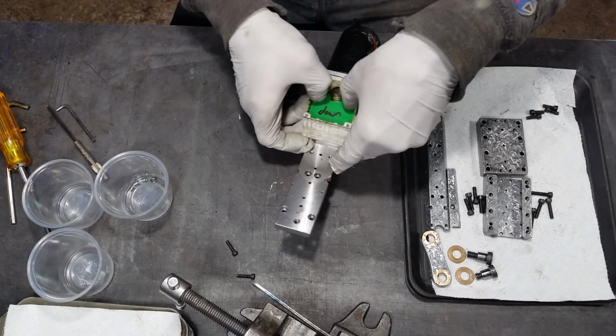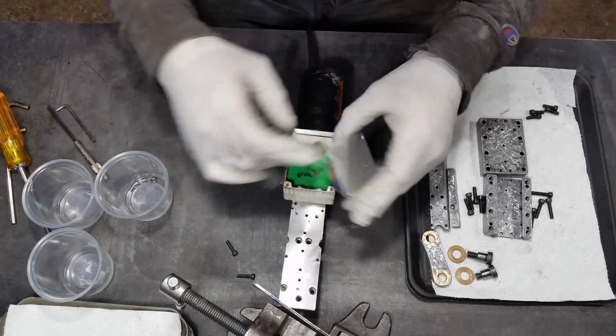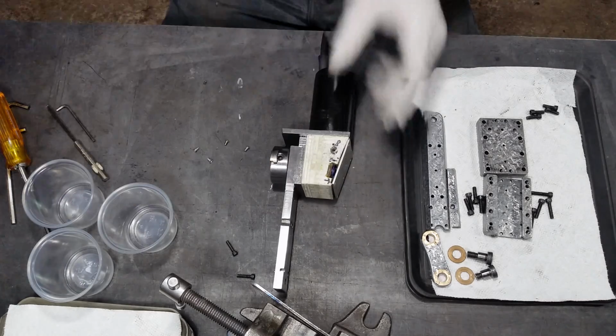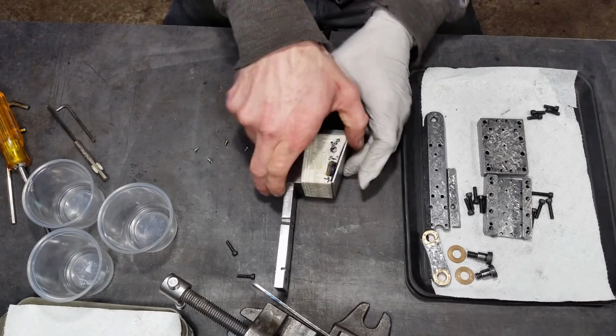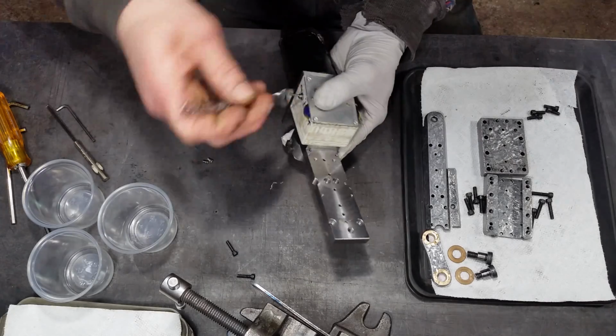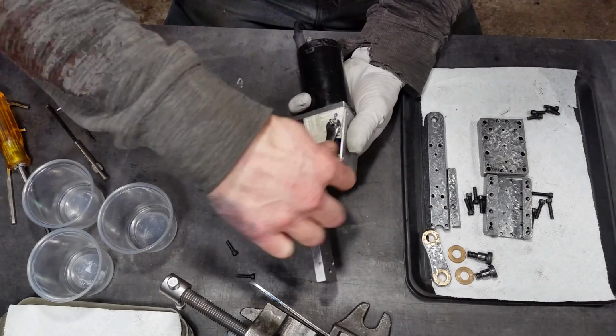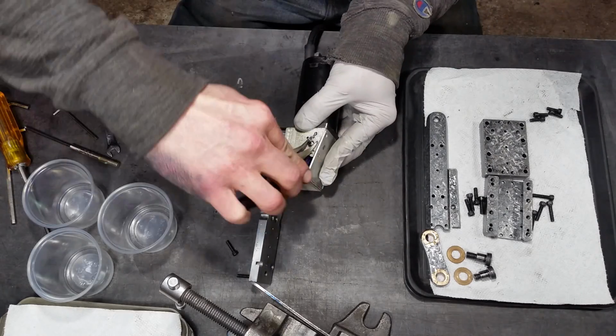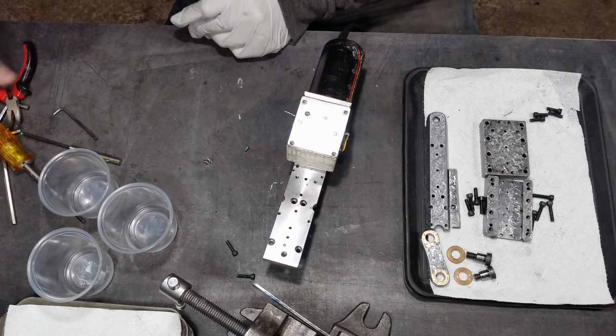And then the housing comes on the top like that. That aluminum shield is also a heat sink for the MOSFET that does the speed control for it. It's a simple 555 circuit in there with a 50K pot there on the side. I do really like the way the controls worked out. I mean, couldn't have planned it better, and I didn't really plan it, so that worked out nice.